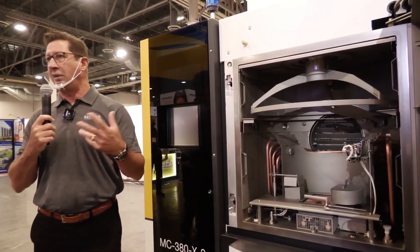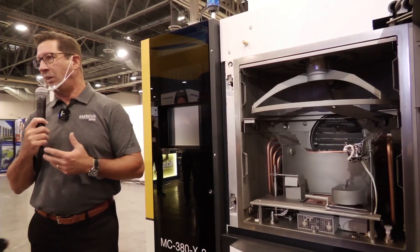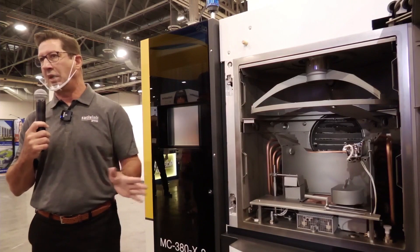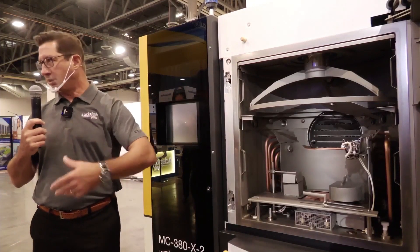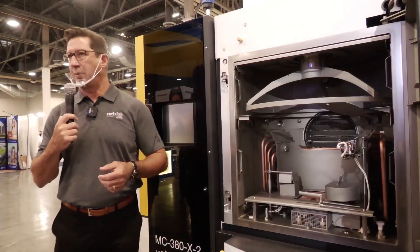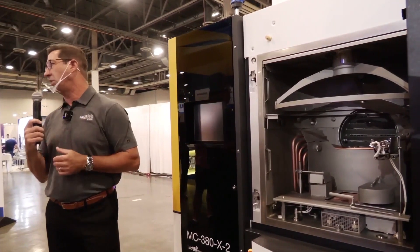Process times will vary between 25 and 32 minutes per side, but the gate valve and the turbo venting allow us to actually close off the turbo — not shutting it off — and do an accelerated venting, saving us another five minutes on the back end of the process as well for the next iteration of processes throughout the day. What that equates to is probably about one more additional process in an eight-hour period of time than previously able to do.